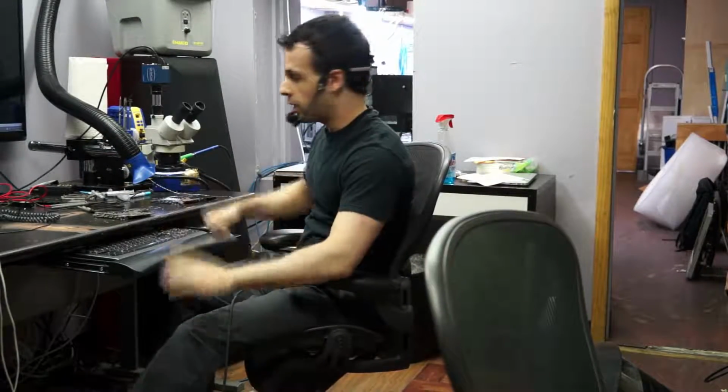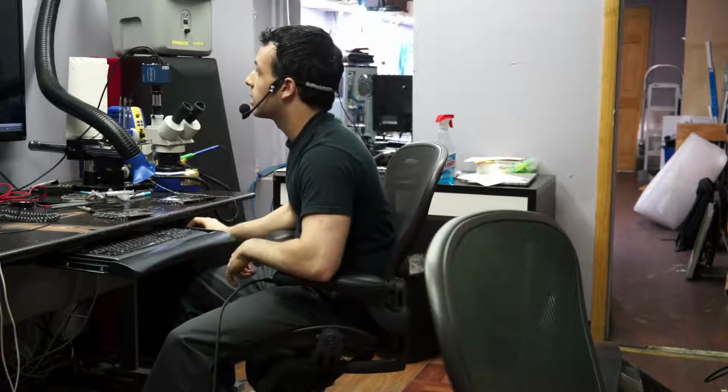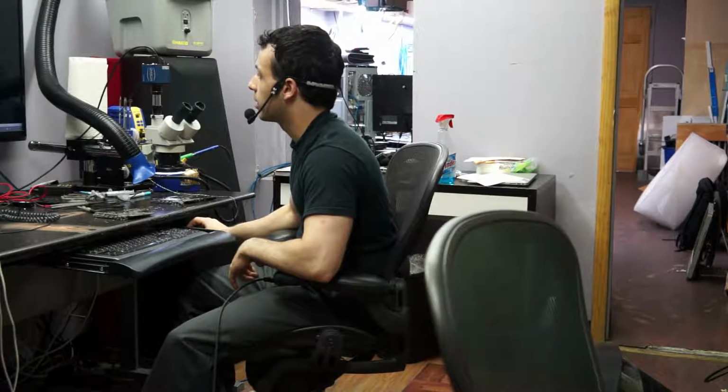All right, so today we're going to be working on an 820-2936 that has no green light in the charger. And also this board will not charge the battery, but it will work just fine off a battery. So I want to start off with going over a couple of things.